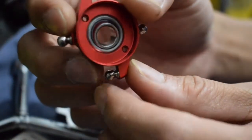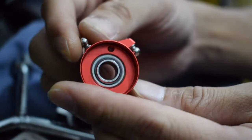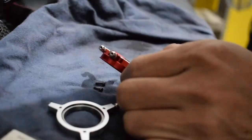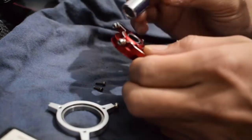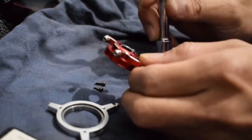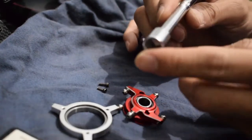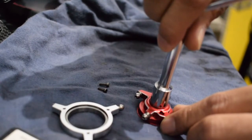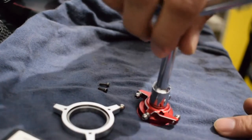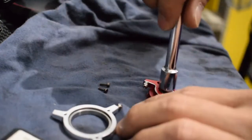Now I have gotten the top part of the swashplate separated from the bottom. I need to knock the spherical bearing out of its housing since it stayed too long and is kind of stuck inside. What I need to do is find the same size rounded metal tube as the bearing so that I can knock the bearing out of its housing without breaking the housing itself.